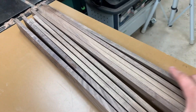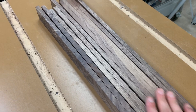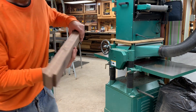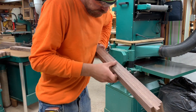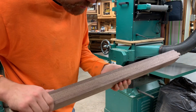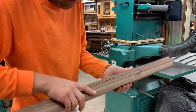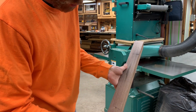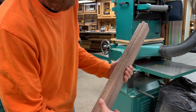Because I have so many multiple pieces, I can stack them up on the planer. I have a bottom edge clean and square, top edge to rough width — I leave it about an eighth of an inch over in width and then plane it down to the final size.